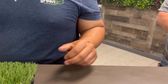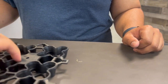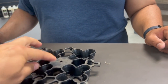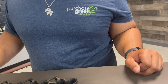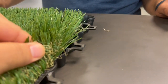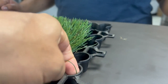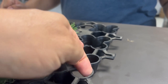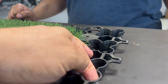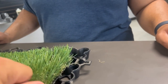Once we set our turf down, we have spots that are easy to staple into, but there's not enough of those. So when we come along here, we take our staple gun and angle it so it shoots a staple into the side. Any of these sides work — anything the staple can grab and stick to. If it pulls back out, we didn't hit something solid, so just shoot a couple more staples in.